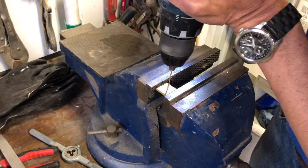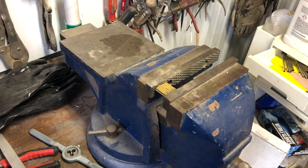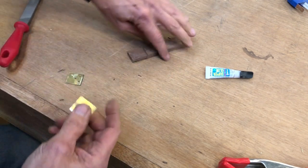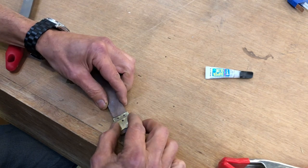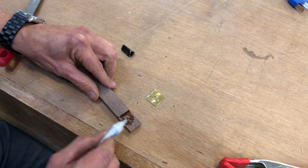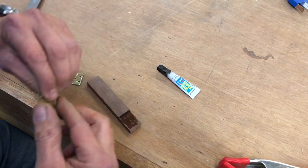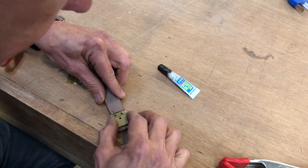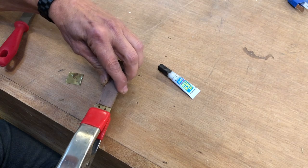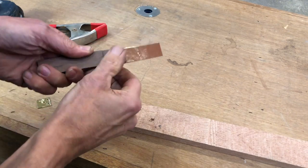Pre-drilled both brass pieces together close to the finished size holes. I did this off of the handles because brass heats up quite a bit from the friction of the drill. This heat would make the glue let loose. I used a piece of cardboard as a spacer to drill the reference hole for the other side.